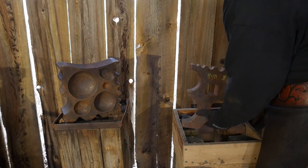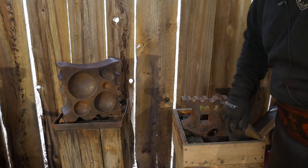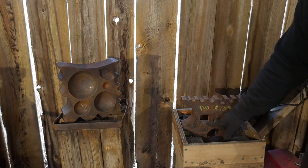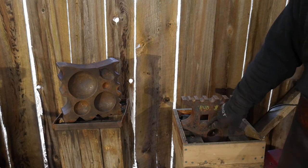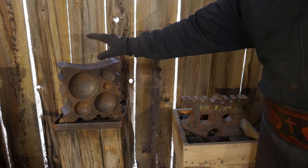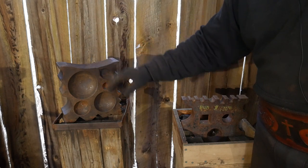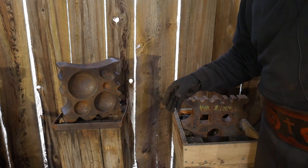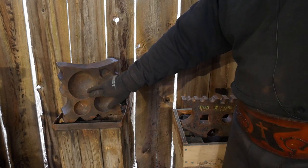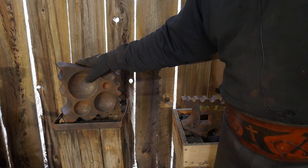These are your two standard types you will see out there in the wild. They will have different hole sizes, shapes, and diameters — triangles and all sorts of different holes you can take advantage of in the blacksmith shop, some handy and some less so. This depression-style swedge block is one of the most handy to have in your workshop, especially if you're going to be doing a lot of artistry-type blacksmithing versus tool-making blacksmithing, because there are many cases where you need a depression to form sheet material over.